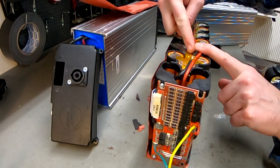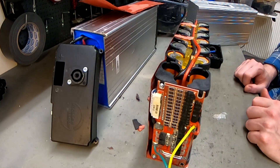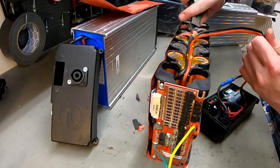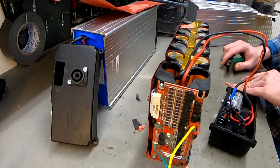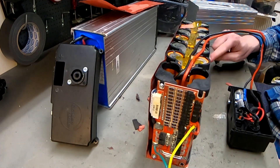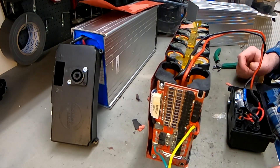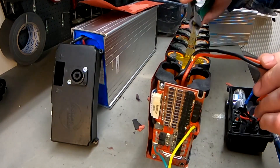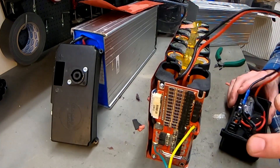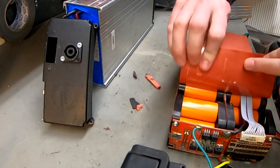The blocks are connected there in the middle — I've never seen this before. He says none of the batteries can charge. It's supposed to be LiFePO4, so it should be like 16s. Counting: 1, 2, 3, 4, 5, 6, 7, 8, 9, 10, 11, 12, 13. It's 13s, so it must be standard lithium ion, not LiFePO4. Each cell should be 3.3Ah. The other battery should be the same — it would be really weird if it's something different.